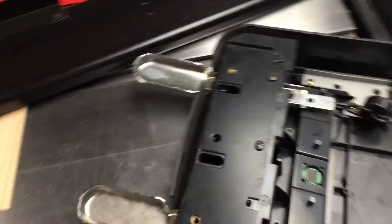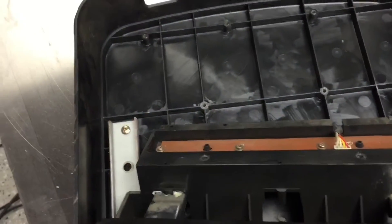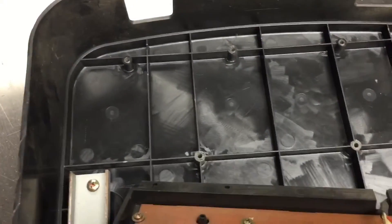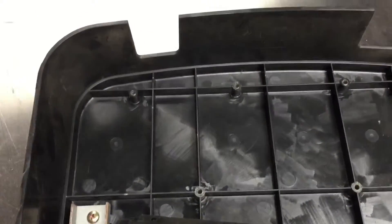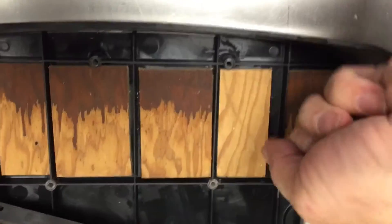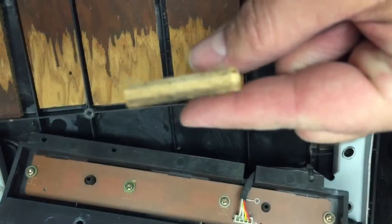This is the underside of the pedal mechanism. I've taken off the leg supports and unscrewed it because I need to drive some screws through this plastic to go into the center stretcher. The problem is this is really thin plastic, so I'm going to have to add some little blocks so the screws don't just go right through it.